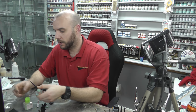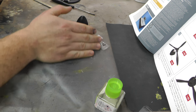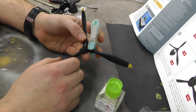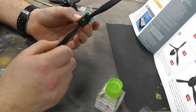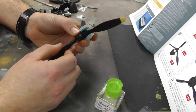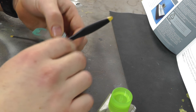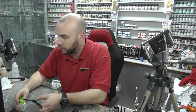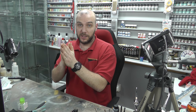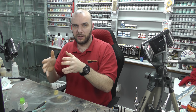I know we did have a screw that we screwed inside here, which locked it down, but I did find that as I was turning it, it almost seemed like it was pushing the plastic up a little bit. So what I've done is I've come along and did some gluing. Now with this stuff, you don't actually glue one side and then bring them together. It's not like a bonding glue, it is more like a reaction that dissolves the plastic.